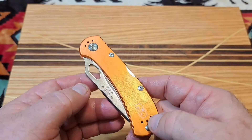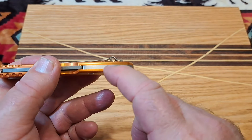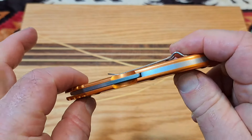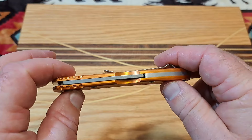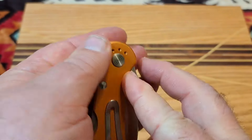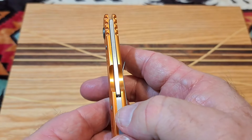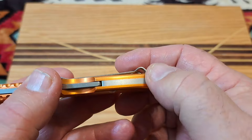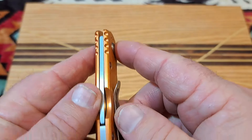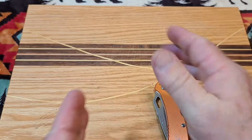That's an engineering problem, and this knife has been out a long time. Buck needs to take this spacer down to 1.8 millimeters — the same width as the lock bar and the blade. Then I believe it would be smooth as butter and they wouldn't have to pinch the blade. I know that's what they're doing because that's the way mine came. They're pinching the blade so you don't see those gap lines. The other option is to make the lock bar stock bigger — go to 2 millimeter stock for both the lock bar and blade so you wouldn't have to pinch it.